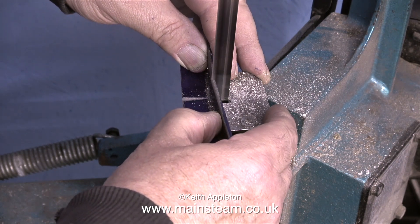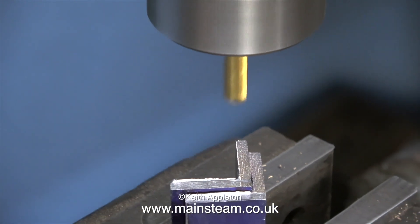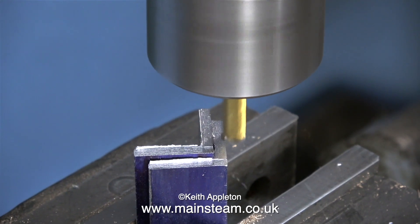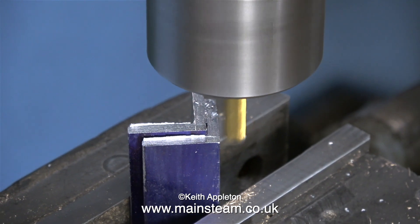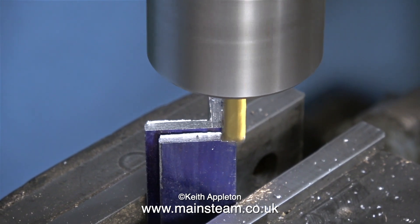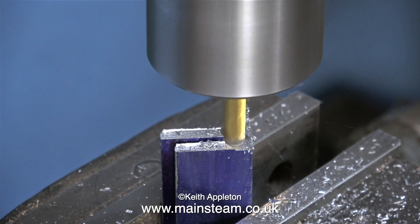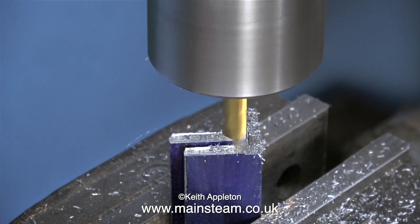The width of the bracket is two inches and an eighth, but I've made it bigger because I'm going to clean it up in the milling machine. I'm using a sharp end mill which is a quarter of an inch in diameter — it's safer to use a smaller end mill on pieces like this. The way I've fitted the pieces of steel angle into the milling vise is a little unorthodox but it's very securely held. I need to go across the work rather than longitudinally to keep side pressure on the pieces to a minimum and avoid the component coming loose.